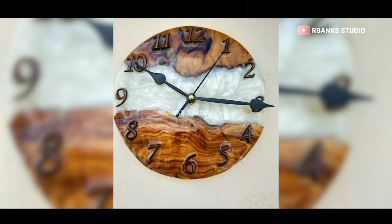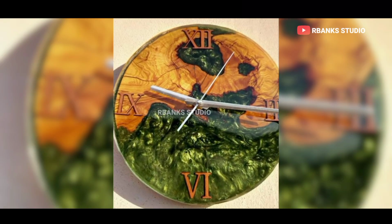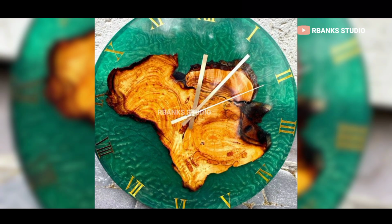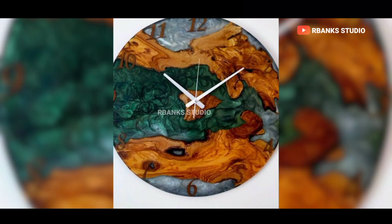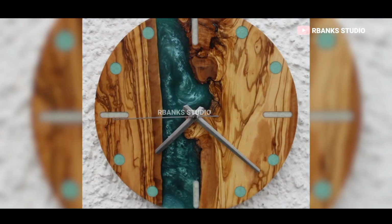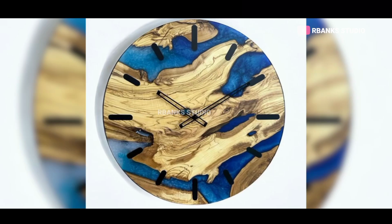With the hole prepared, it's time to secure the clock mechanism. Insert the shaft carefully through the drill hole, ensuring the back plate sits snugly against the resin's rear surface. For thicker designs, add a spacer or washer to maintain a firm fit. This prevents the mechanism from shifting during operation, which could lead to inaccurate timekeeping or unwanted noise.